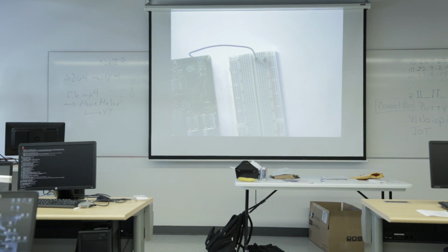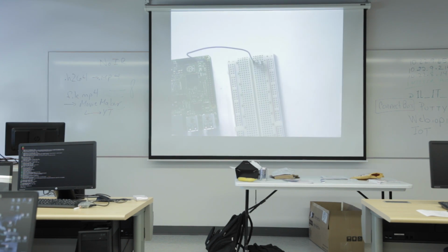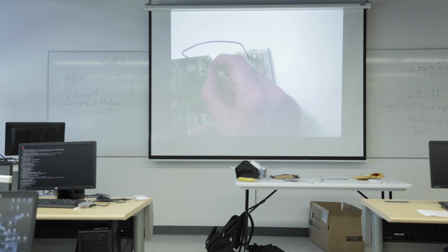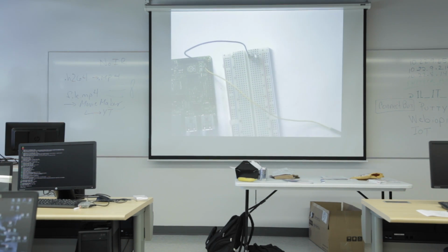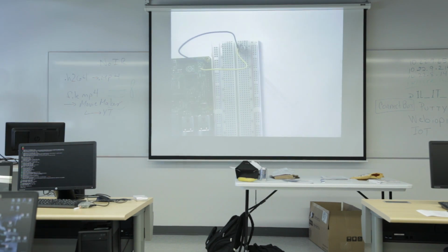Next, we need a resistor between the 3.3 volts in and the next one over. So you take one end of your resistor and put it in that line. The other end of the resistor goes in the one directly beneath it. Now you take the second wire and count 2 away from that. So 1, 2 empty pins, and then put this one down. It's the 4th, going directly above something that says GPIO. The other end, the pointy end of that, will go right next to the other wire that you plugged into the breadboard.